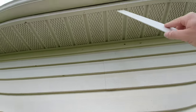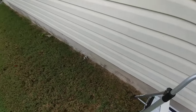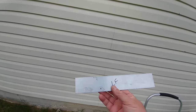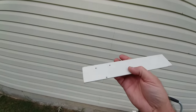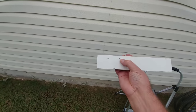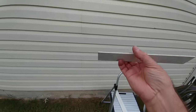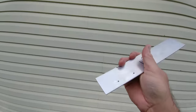So then I cut a strip and actually found some paint that matched my soffit and painted the strip. Then I came up with a smaller piece like this — I marked this one 'left front.' I used the template that came with the cameras and screwed holes in it. When you screw the camera to it, the screws are going to stick out the back a little bit, so I just took a grinder and ground them flat so they wouldn't poke holes in the soffit.